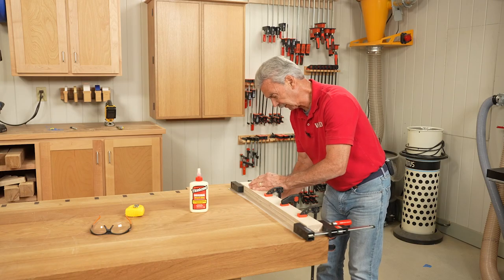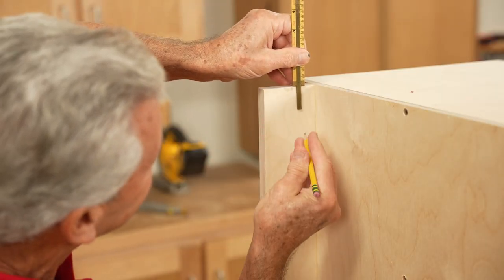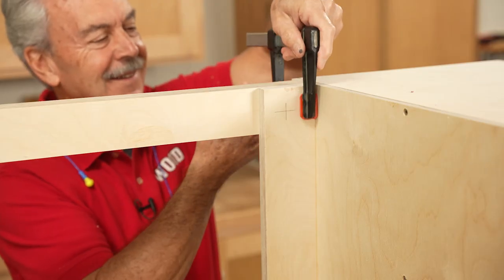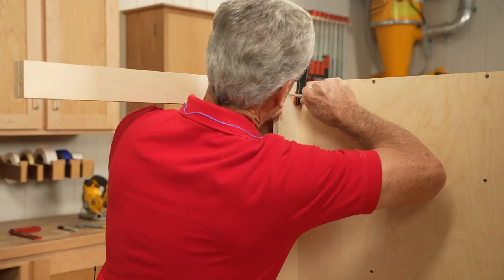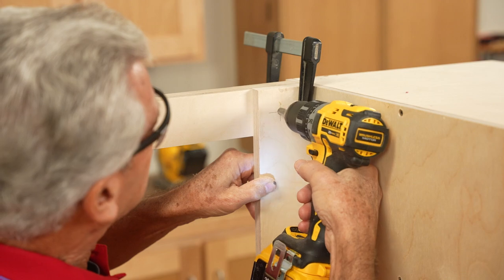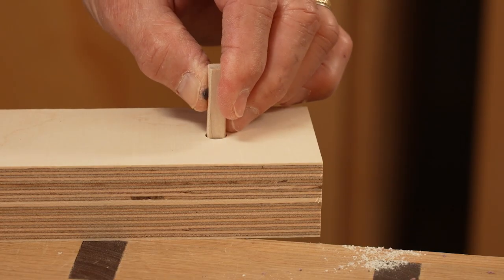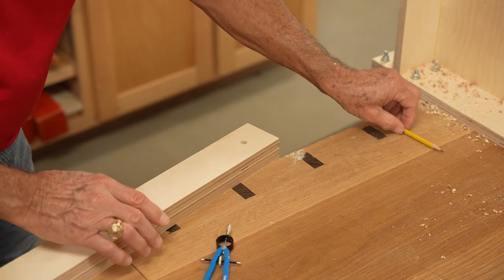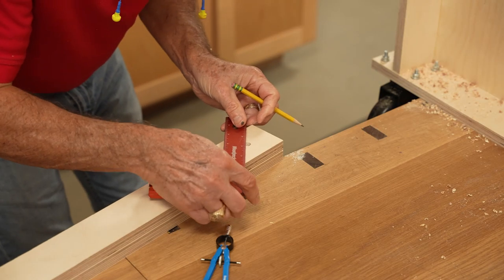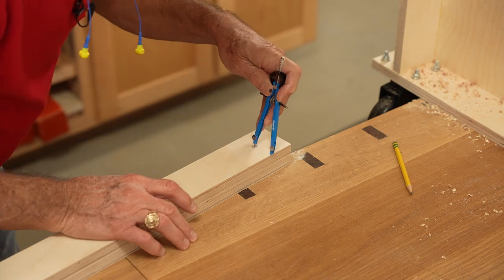These will sit until thoroughly dry — this is one; I've got one more to do. To set the pivot hole in each of the two ribs on just one side, I set my folding rule to mark an inch and a half in from the side and an inch and a half down from the top. Clamping a pivot arm to the outside of the rib, I use a 3/8-inch drill bit to drill a hole from the rib all the way through to the outside edge of the pivot arm. The top of the pivot arm needs a radius, and to locate a center point I cut a 5/16-inch square peg and insert it into the hole. Drawing the diagonals on that peg gives me a center mark, and using a compass set for the outside radius I draw the radius.